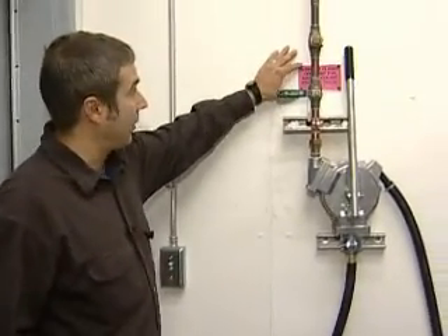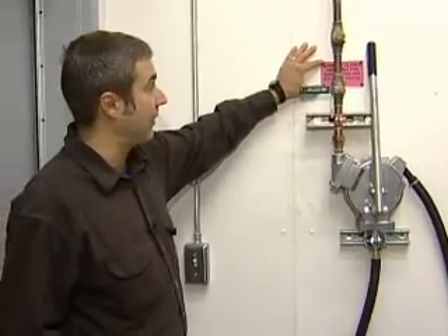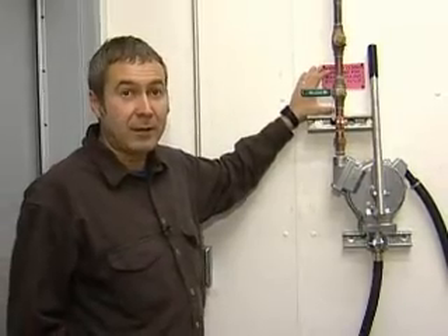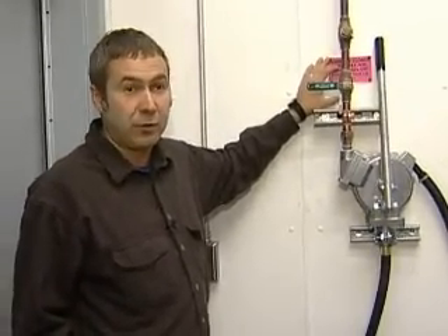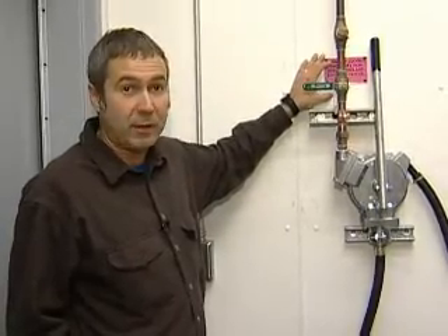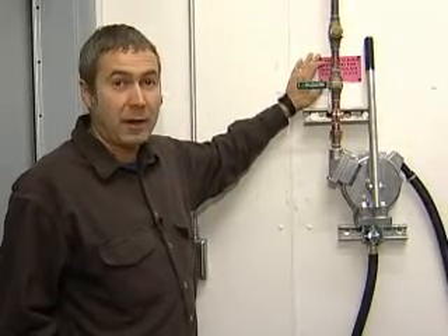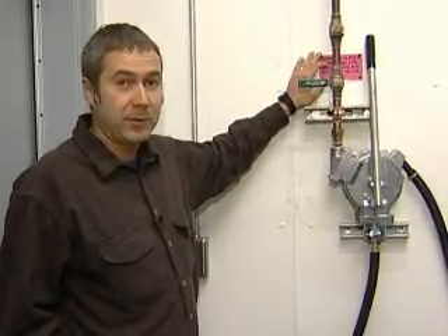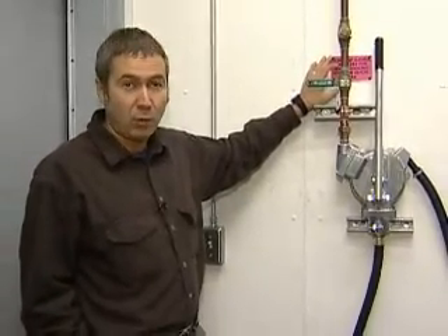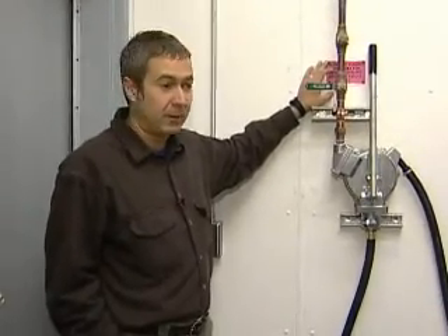If you get a little low, there's a port here for adding glycol. I want to make note — this valve is tagged normally closed, open only for adding coolant, ethylene glycol only. You have to add the same brand and the same mixture of glycol to the system as what is already installed. Verify what is in the system and only add the same product. Generally this should be bought pre-mixed, usually 50-50, sometimes 60-40, with treated water. You don't ever want to add local water to the system because the minerals in it can clog up the cooling system.